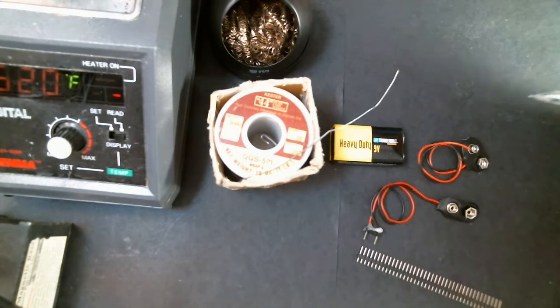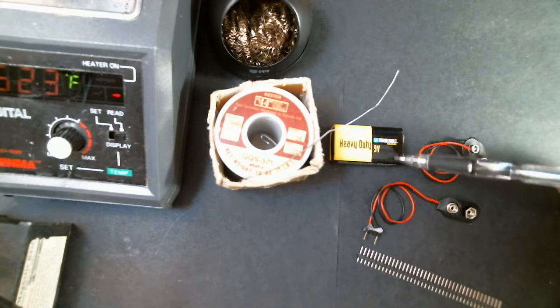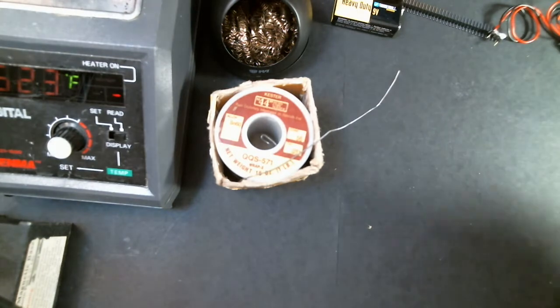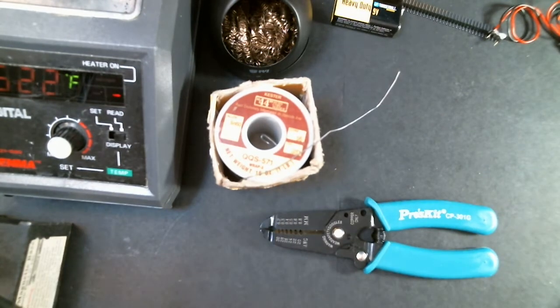You'll be pulling the two pins out using some needle nose pliers or the tip of your wire strippers, and you'll be soldering on the ends. The tools you'll be using — you should be purchasing a set of wire strippers; the brand doesn't matter, but it has to be able to do 22 and 24 gauge. Red and black wires will be 22 gauge, and the cat5 and telephone wires will be 24 gauge.